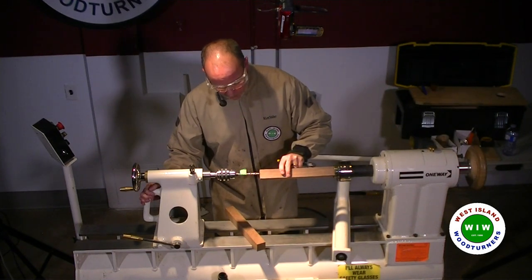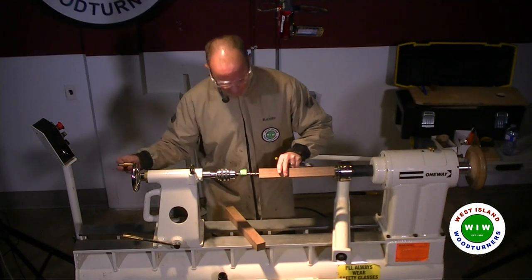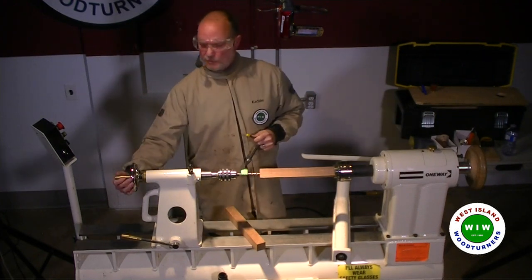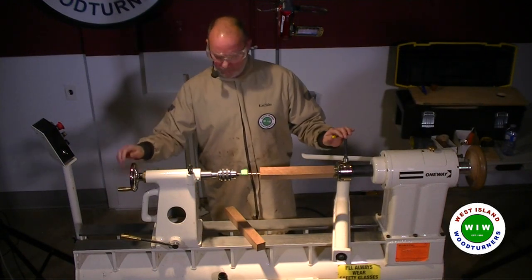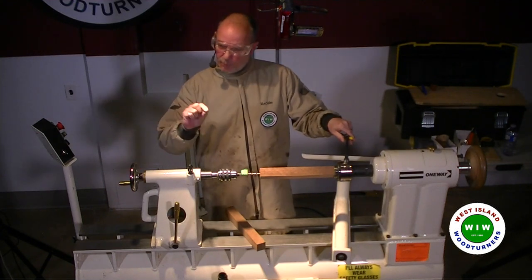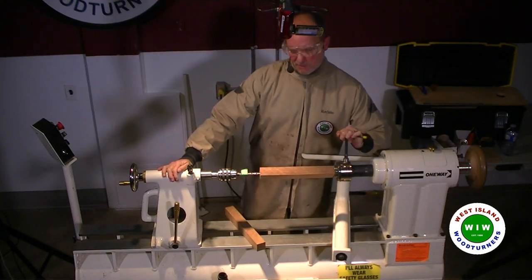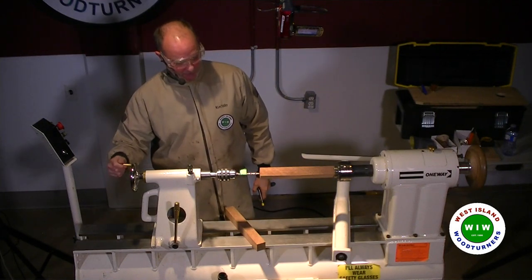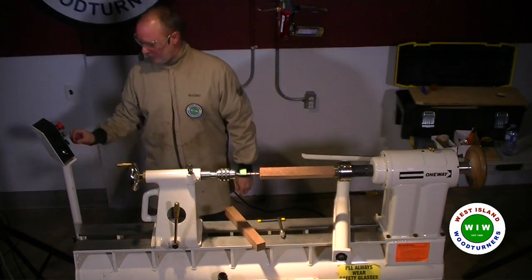This particular drill bit I have here, I forget the actual name of it, but it's the one that's got the nice big sharp brad. It's got the brad drill, a nice pointy bit on it. I was using regular ones before, and I thought, well, maybe if I have a nice pointy bit that lines it up, it'll help. And sometimes it does, sometimes it doesn't. It depends on where the grain goes, and sometimes the end's not perfectly flat, and all kinds of things happen.